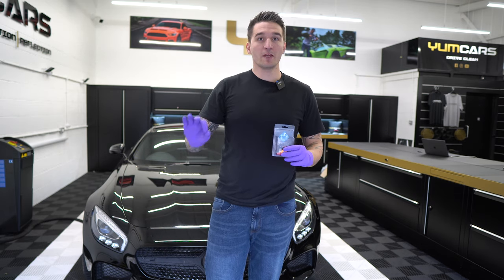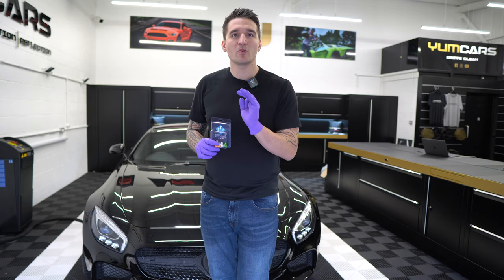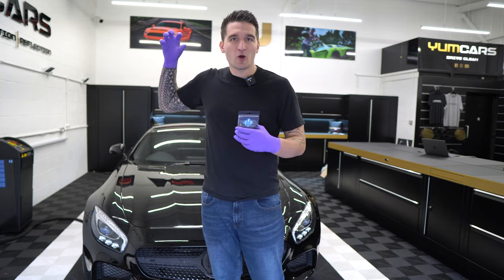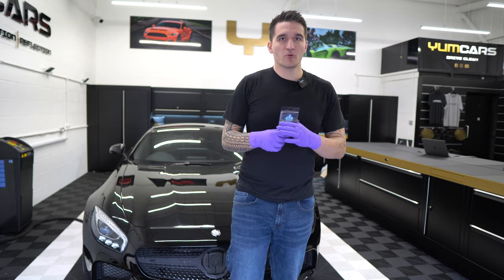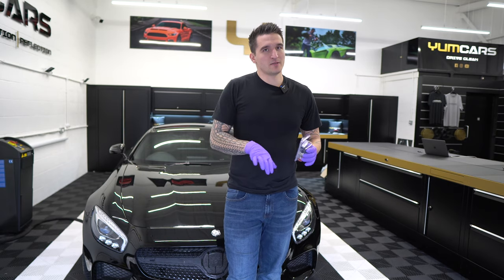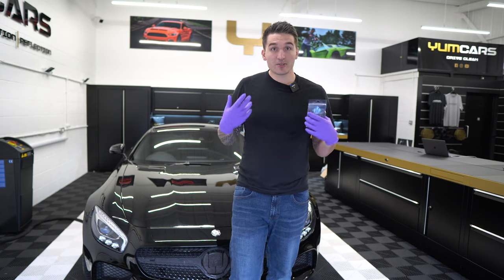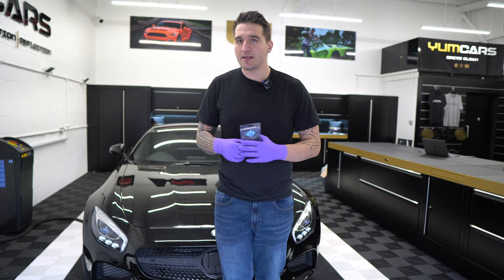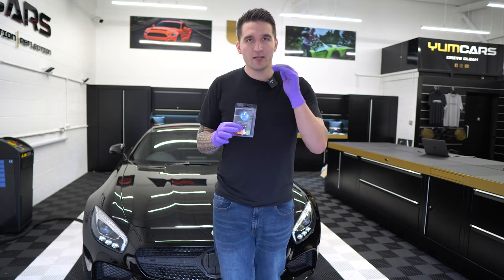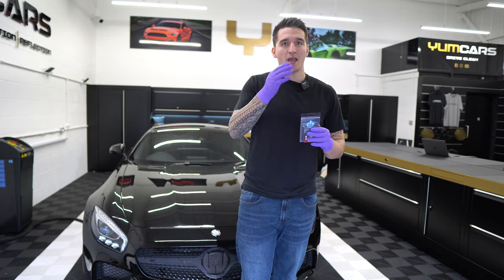Now, I'm going to give you the worst example. If you've got, let's say, an 1152 Kranzle and you go for the smallest orifice, just imagine you've got that whole torrent of water and pressure going through the smallest of holes. You can imagine what happens. It creates back pressure into the pressure washer, and that's going to cause internal damage, and eventually it'll just go boom.